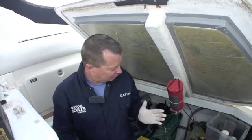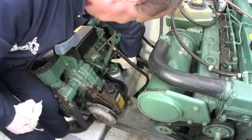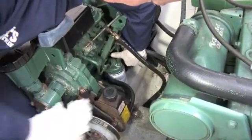That's how to change the fuel filters. It's important that you as a boat owner understand how to do this — not only because it's part of the annual service regime, but also because fuel filters can block out at sea, and if you don't know how to change them you might find yourself without a running engine. Changing the filters is only part of the equation; now you need to bleed the system to remove any air, and we'll be showing you how to do that in the next video.